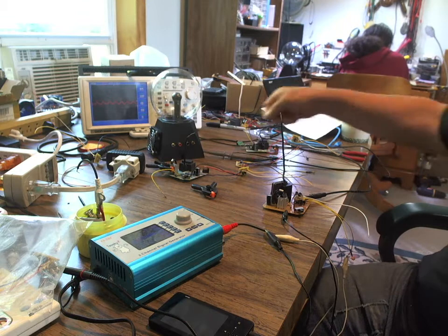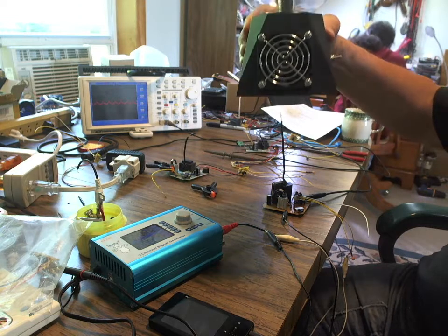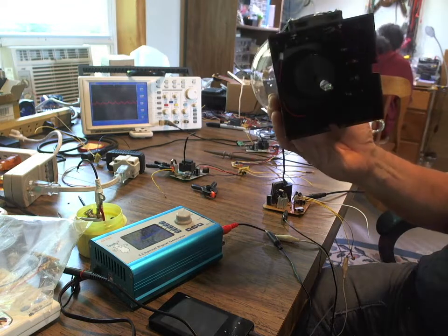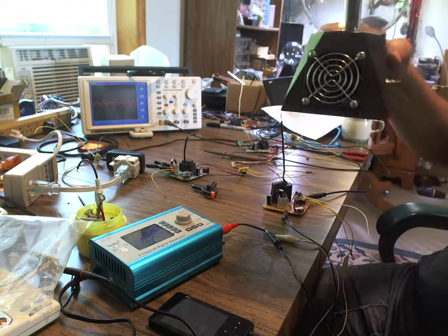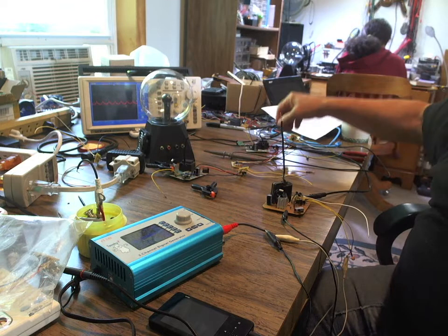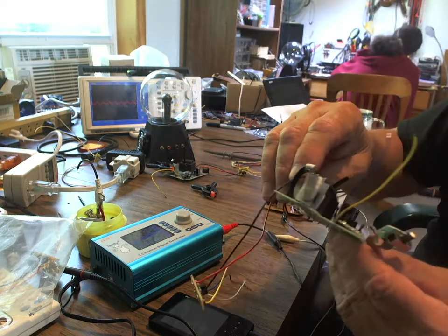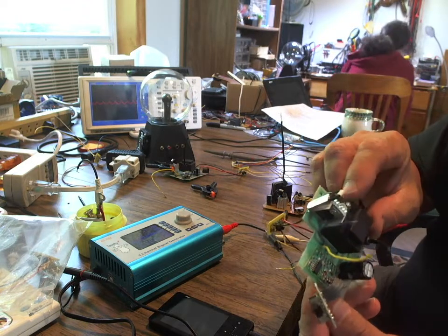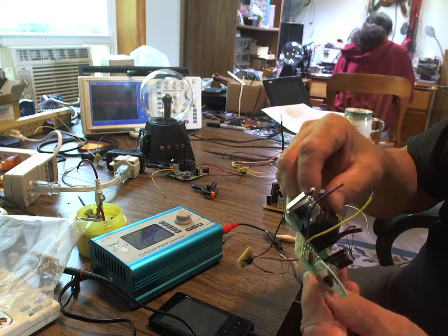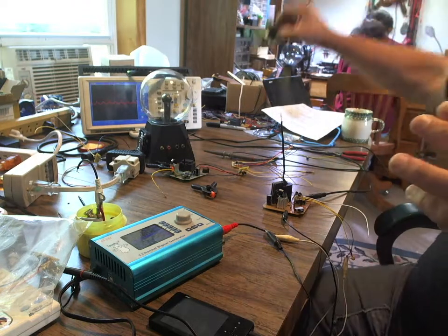We are now putting fans on all our plasma balls to help cool down that driving transistor. You don't have to add a fan, but it'll cut out a lot quicker without one. That's what the thermal switch was for — right here on this particular motherboard, still mounted on the side. You can see how the heat sink glue has attached it very nicely. It's that silver thing — a silver thermal switch.